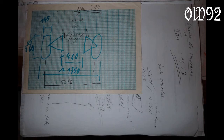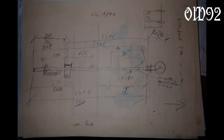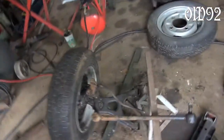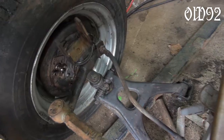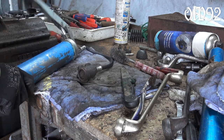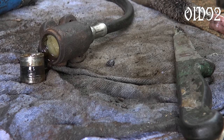Now it was time to create some frame, and especially the front axle. For that purpose I used the GDR Trabant front axle. The brake system wasn't working anymore, so I had to do some maintenance to the brake cylinders. But how to remove those rusted pistons? I came up with the idea of using a grease gun — not that kind of grease gun, but a grease gun with actual grease in it. It worked just fantastic.